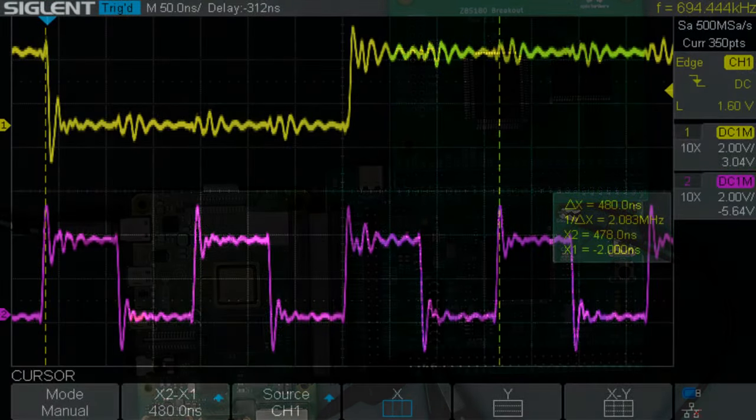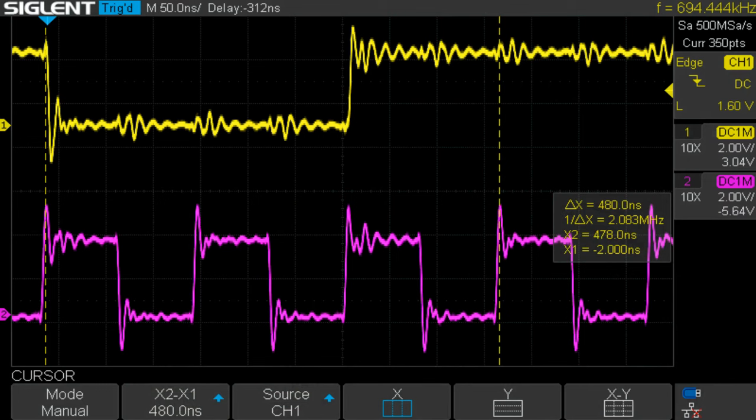If we look over at the scope, what I've got here is these two. You can see the cursors, the left and right cursor. We see 1, 2, 3 phi signals. The purple trace is the phi clock. The M1 is the yellow trace at the top of the scope, and that's where the trigger is connected. So what we see is for two full periods of the phi clock, M1 is low, and then the third full period, it is high. The next instruction would come after that if it was moving on right away. In this case, it is not, because we're executing a jump instruction in a spin loop, and that requires it to read three bytes before it moves on to the next instruction.